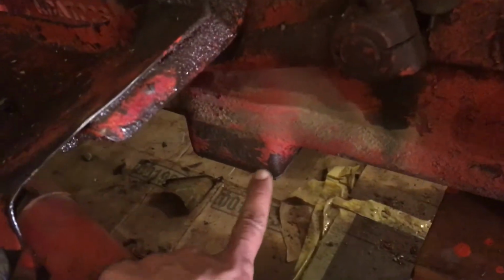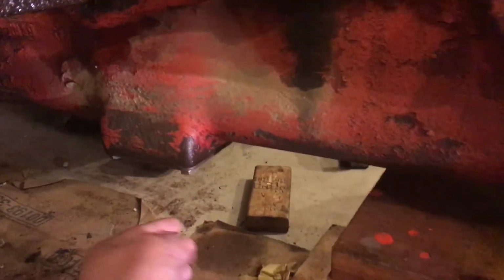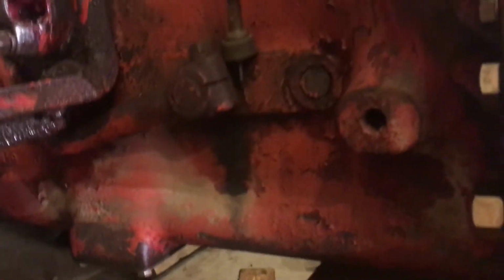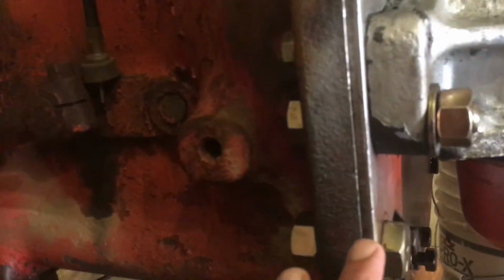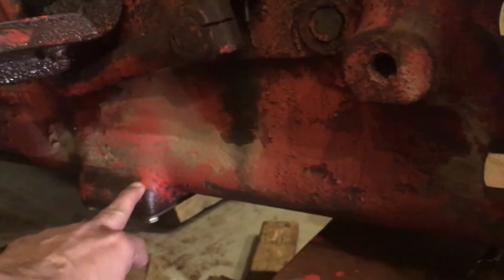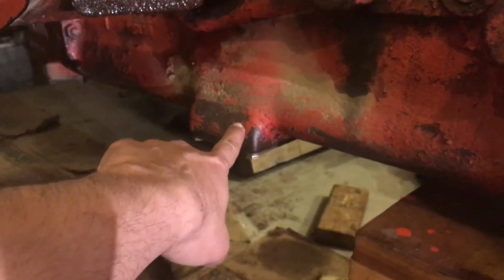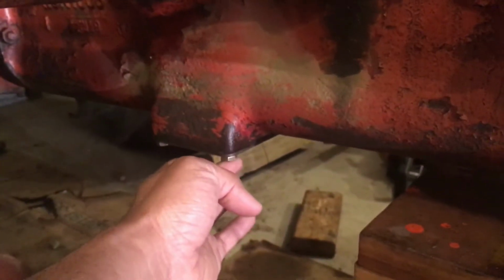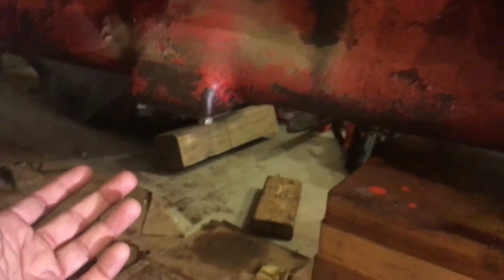One more thing I did: there is a square box under this transmission, and you can see there are 4 bolts. This one is a plate. Before installing the engine, I tried to clean the bell housing and found a lot of dirt inside. I thought it was tiny dirt I could scrape with a paper towel, and I did. But then I realized there was one bolt missing, and there are 3 of them. So I removed the plate, and a big chunk of caked dirt came out, like a half-inch thick loaf of dirt.